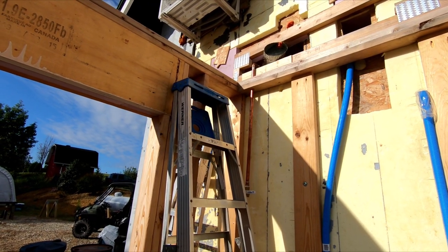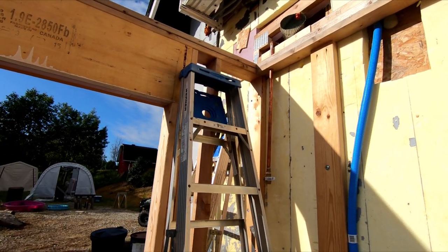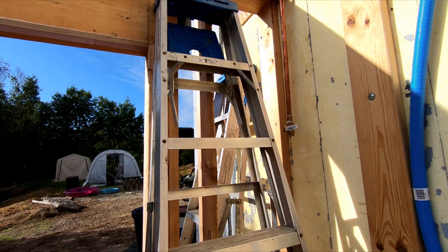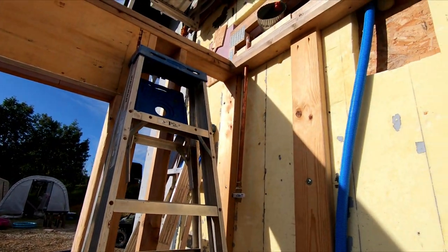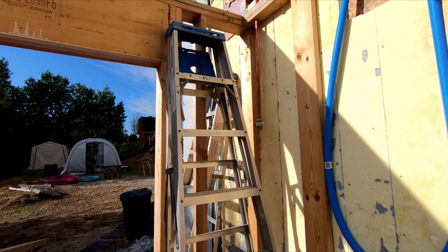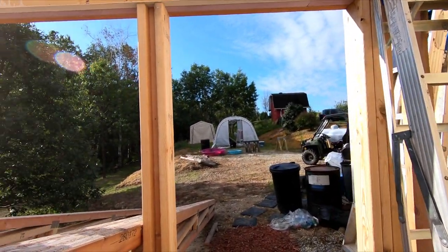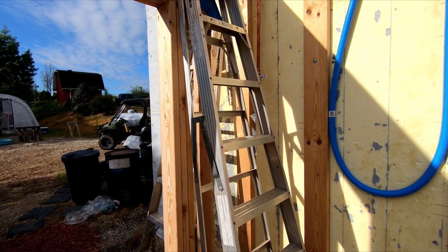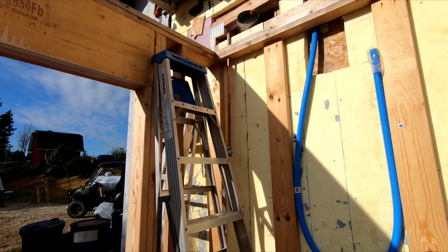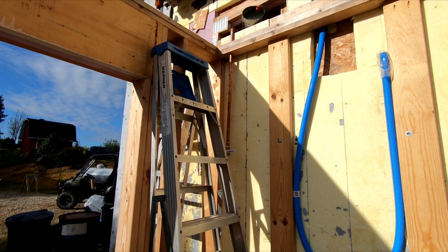Thing is, it costs a couple hundred dollars for the tools if you get the stretchy, I don't even want to know what it's called. There's the crimp-on PEX, and then there's expansion PEX. And the expansion stuff is, I guess, better. I don't know about longevity, but it's definitely better in that it doesn't reduce the water flow. It has full water flow. So that's probably what we'll go with, but then I've got to buy a new tool.